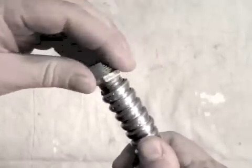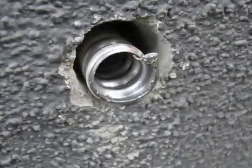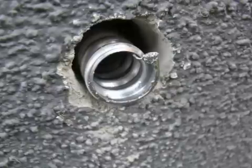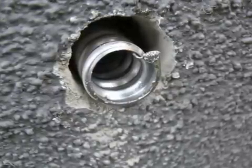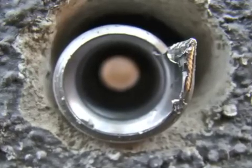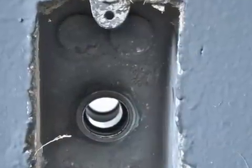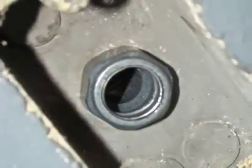I'll remove the threaded ring first from my 1/2 inch connector and screw it onto the end of my flex pipe. Before I insert the connector end of my flex into the hole, I've got to bore out the hole so it's big enough to fit through. I simply insert the flex pipe and maneuver it until the threaded end of the connector inserts into the knockout opening. By accident I got a 3/4 inch compression fitting connector — since it works, I'll use it.